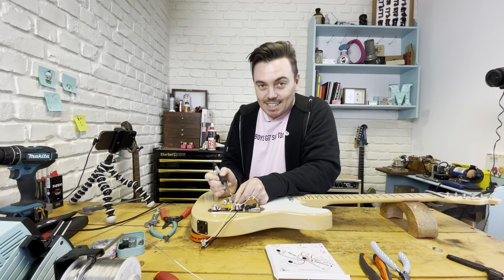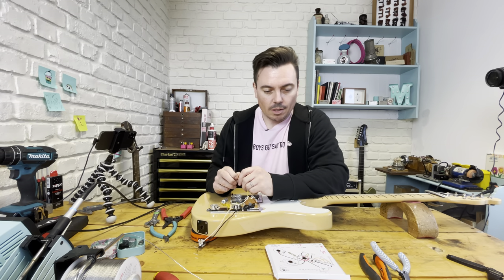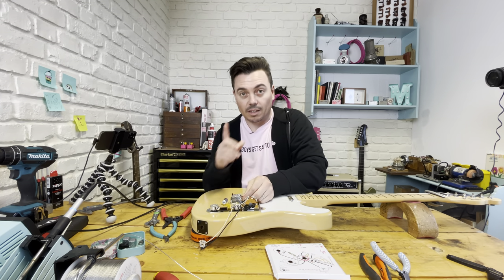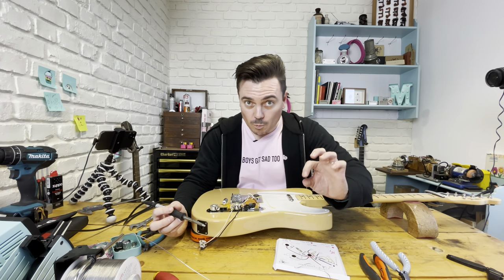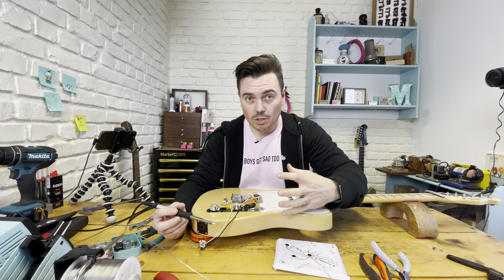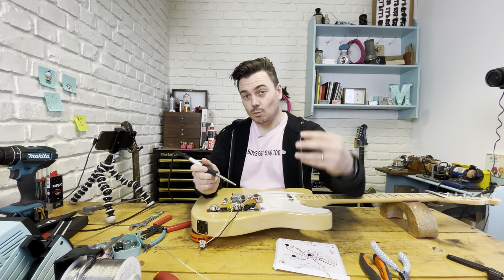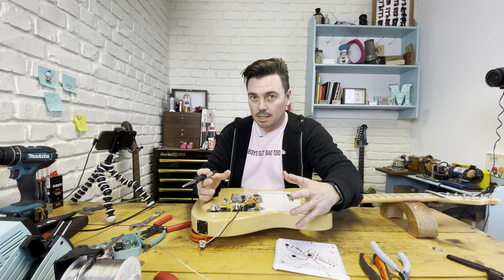Be patient - as soon as it goes liquid it will drop down, then take your heat off. So now we've got the bridge ground, the other ground left over, and that goes to the lug on the furthest right of the switch, the lug closest to the volume pot. Just tin that a little bit - easier for soldering. That lug is a really small thin piece of metal so it's going to heat up fast. If you leave your heat on for too long, basically the solder can flow into the switch, so you don't want that. But if it does happen, take your heat off, let everything cool down, and then use gravity as your friend - turn it upside down to get the solder back out, and nine times out of ten you can save it that way.